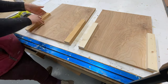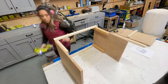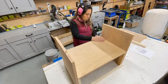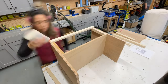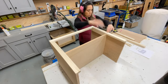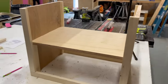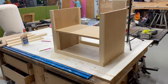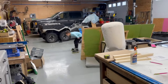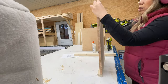I used plywood for the carcass of this project. I ripped it first on a table saw to a 15 and a half inch width, then cross-cut it using my miter saw. I took the sides and blocked them out with some 1x2s to help support both the face frame and the drawer slides. I'm nailing this entire project together with one and a quarter inch nails — since you're not sitting on it, nails are just fine, easy to hide, inexpensive, and quick to drive.